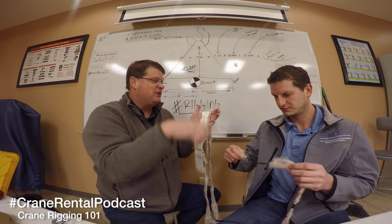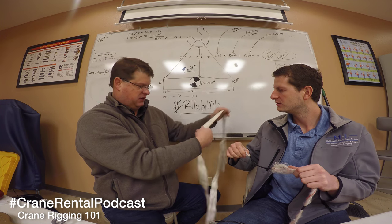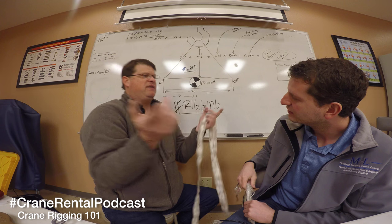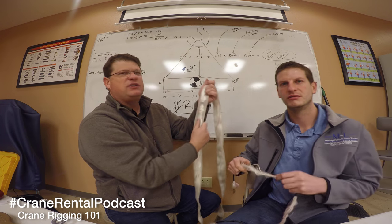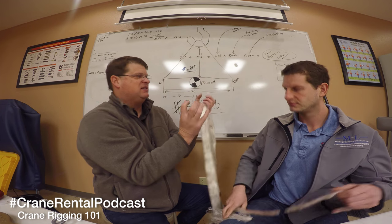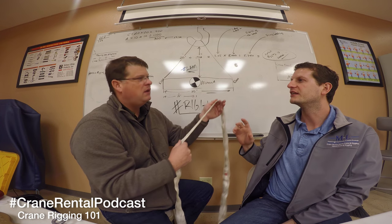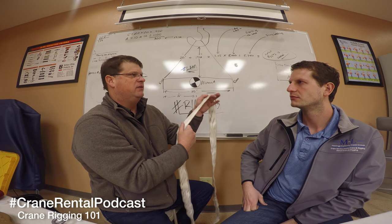Those knots are normal - it's just where they go to the next spool and make a knot and continue on. What you don't want to feel is if you were to damage one of these under load, the fiber will spring back and become like a soft little ball - soft and wadded up. That's what you really don't want to feel. So there are some normal things you should feel and some things you shouldn't. By seeing through this clear training cover, you get the experience of what you're seeing and feeling in the field.